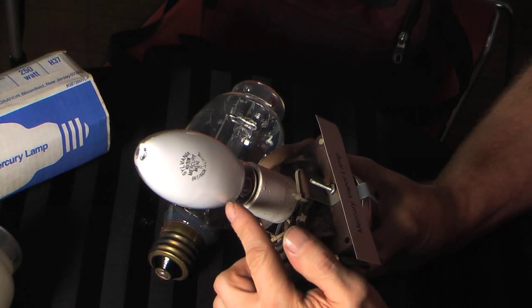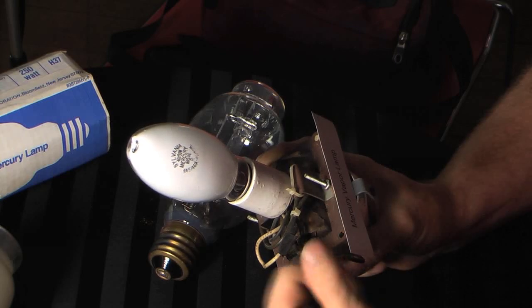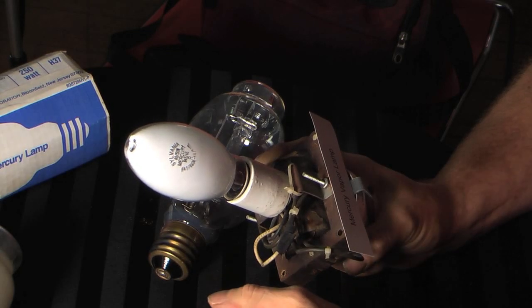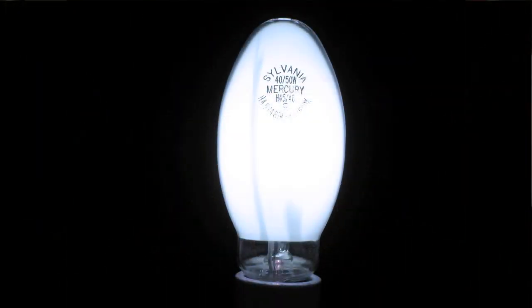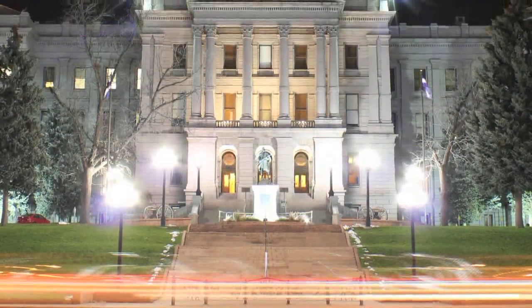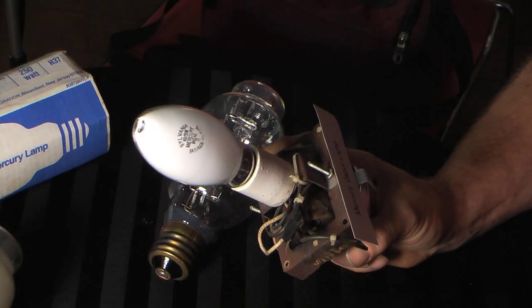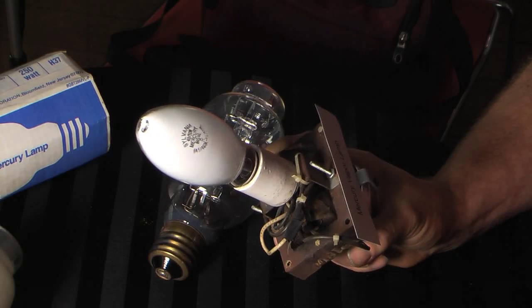This lamp actually puts out about 15% more light than the equivalent clear lamp, while at the same time providing a crisp cool white color — almost like a cool white fluorescent — with pretty good color rendering, so you can even use them indoors. A lot of street light fixtures used these deluxe white lamps until high pressure sodium came around, and there are still some in use; they're easy to identify. Any street light you see that lights up a crisp cool white color has this type of mercury lamp with the yttrium vanadate phosphor — probably in a bigger wattage: 175, 250, 400, maybe 700 or even 1000 watts depending on the fixture.